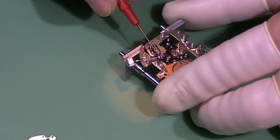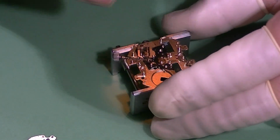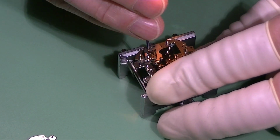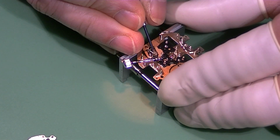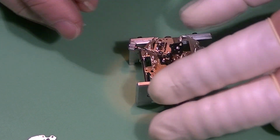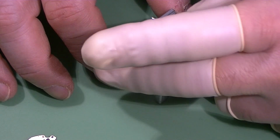Also here, a little bit of grease. This is not oil, but it's grease. Then this is gonna be metal to metal rubbing. Just gently screwing down the screw and then tightening it so that everything works correctly. And now putting the spring part of this plate lever in place so that it engages with the switch lever. Sorry, with the setting lever. And now I need to test everything out, if it works well or not.